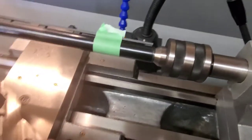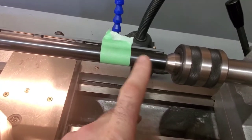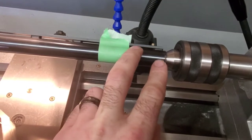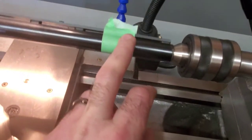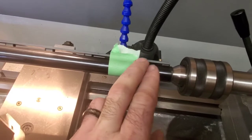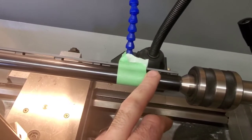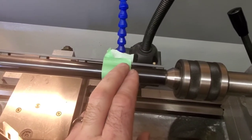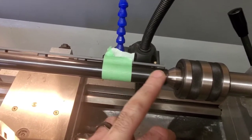What you got to do is indicate the last, probably about like this, about 1.5 to 2 inches. You indicate that true because that's the portion you're going to be machining. And at the end of the bore of anything, shotgun, pistol, rifle, the length of the barrel that has engagement surface corresponding to the bullet or wad is what matters. That's the last portion of the barrel that's going to actually direct the alignment and the direction of where the shot's going to go.